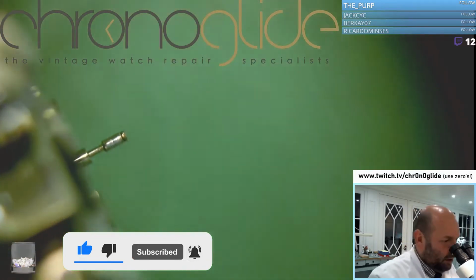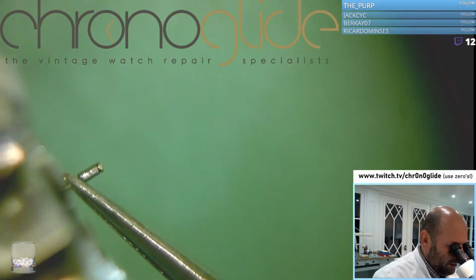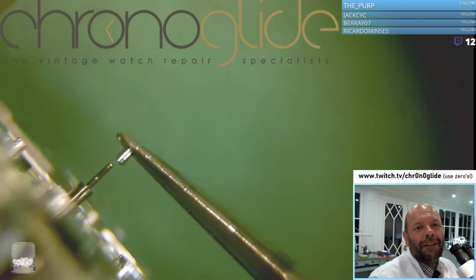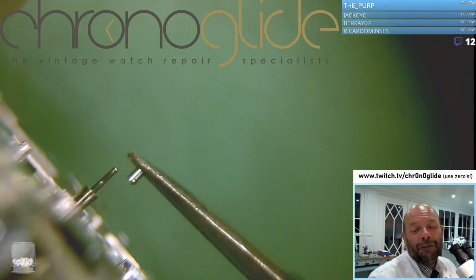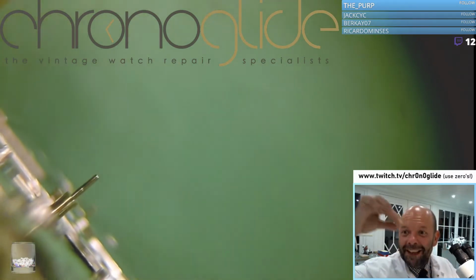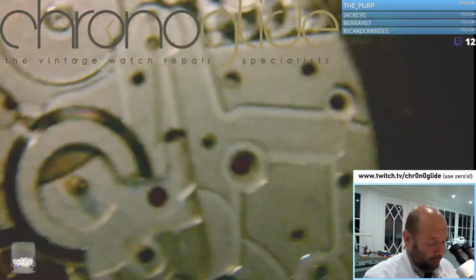You can see this is the most important bit. And now it's very easy to take out. You can see there's no damage to the pivot of the central chronograph, and most important, because we took it off straight in one line, the pivot isn't bent, and that could have been a problem.